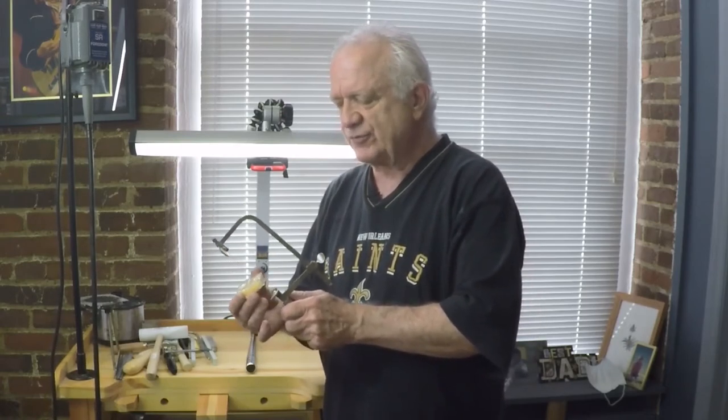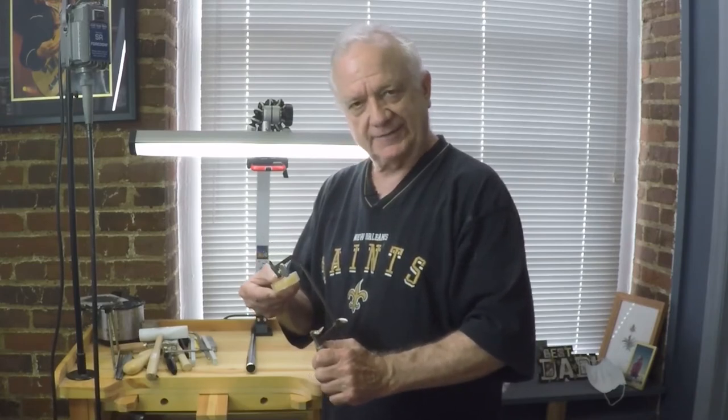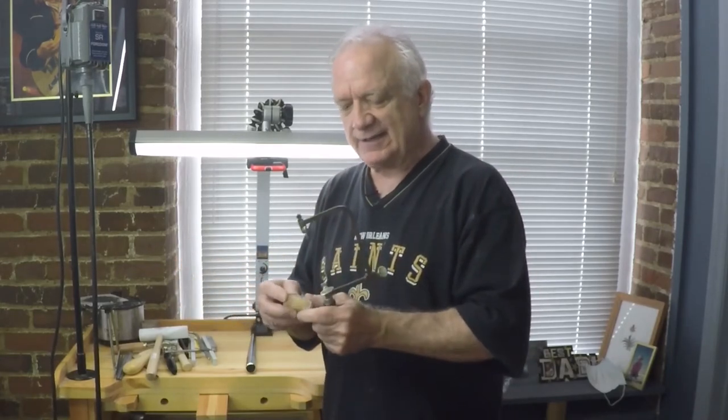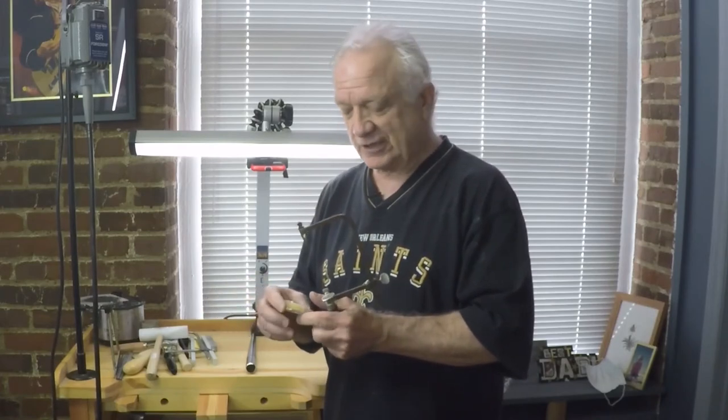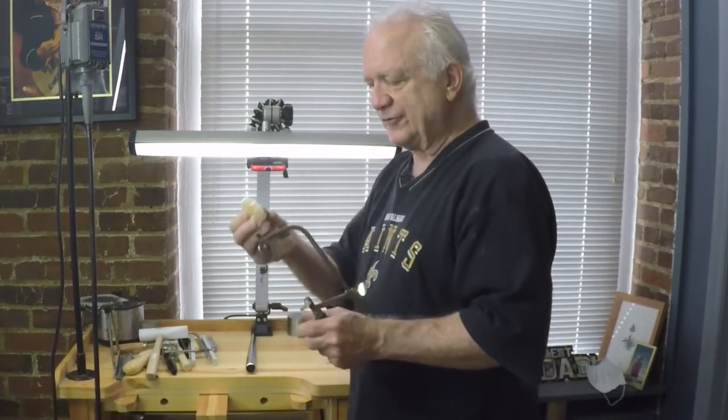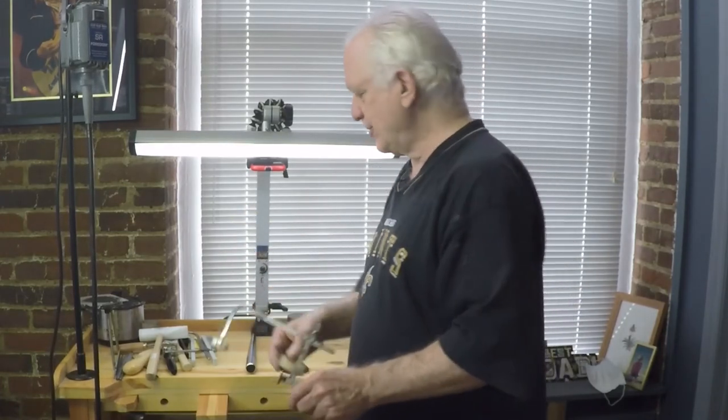With beeswax, you can take your blade and just run it one time along the teeth. But a better way to do it is to run your beeswax on the back of the blade. If you put it on the front, the beeswax is going to dissipate real quick. Put it on the back of the blade, and it lasts about 5 times longer. Just a trick I learned from a German metalsmith. So beeswax or a candle to aid in your cutting.